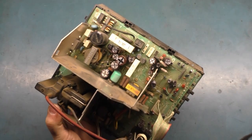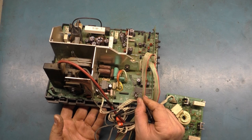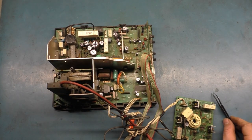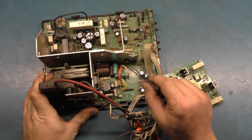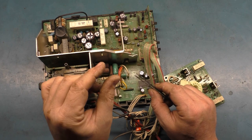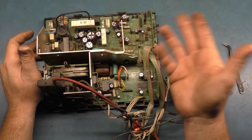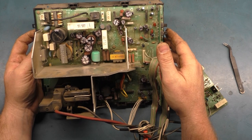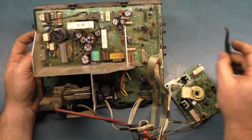And yeah, so if you have one of these MS9-29SU, and you work on it, recap it, reflow it, whatever, I would highly recommend reflowing, inspecting and repairing the pads on the horizontal width control transistor, or you'll probably end up with width problems at some point. I think we just had a little sliver of solder still going to the trace or the pad that allowed it to work, but I'm pretty sure we might have had width control problems in the future if I hadn't found that. So that's the only anomaly I found.